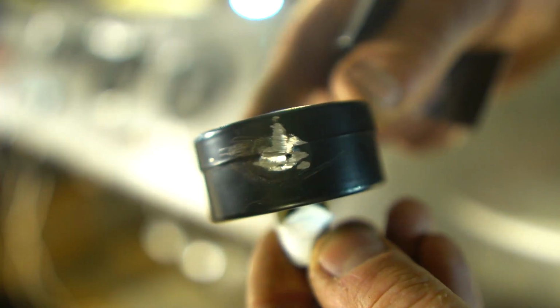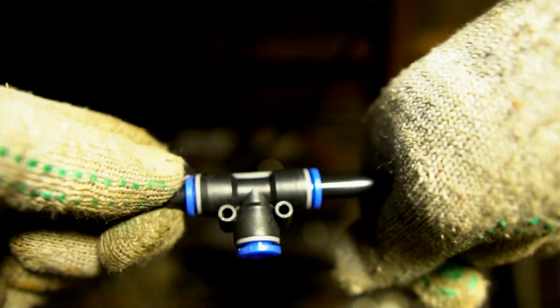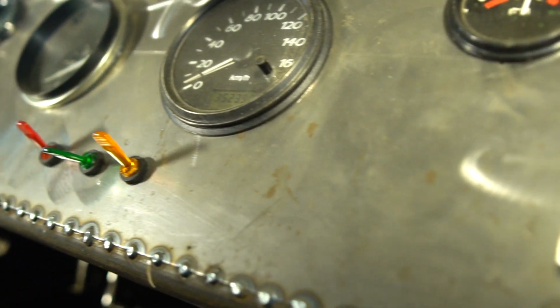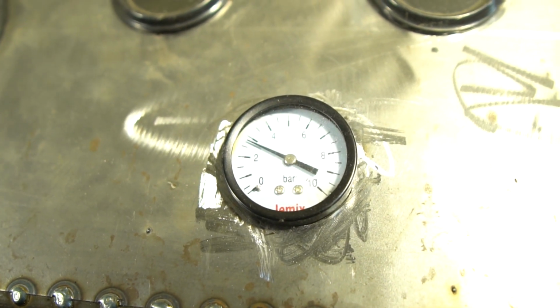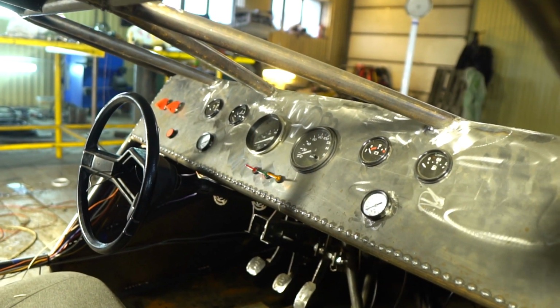The pressure gauges had to be slightly modified as they were not adapted to be placed on the panel. I welded the cover to the cabin so that it couldn't fall off and made the support bracket. They'll be connected right after the valves on each airbag. That's all with the devices for now. A pair of control lamps and tumbler switches may still be added along the way.